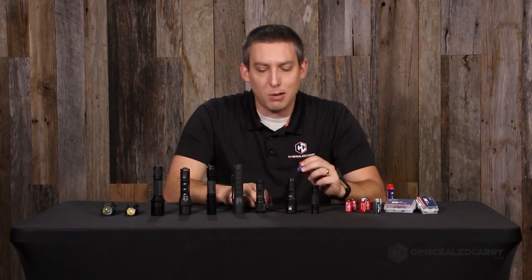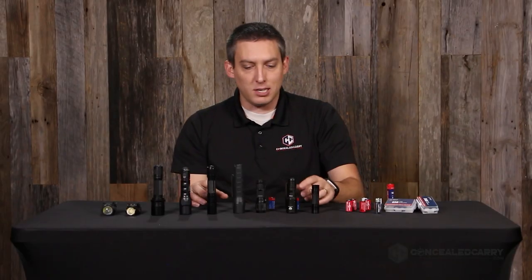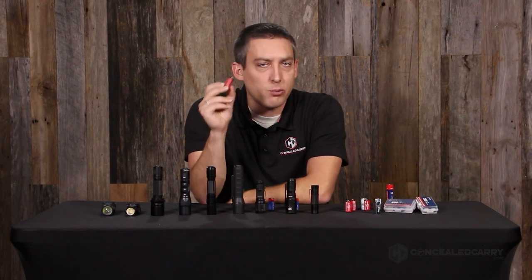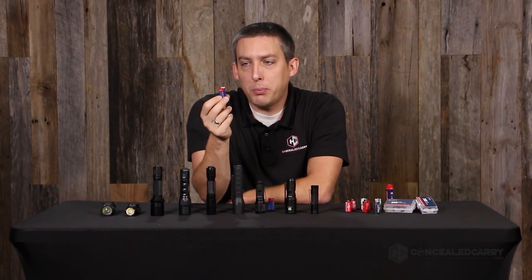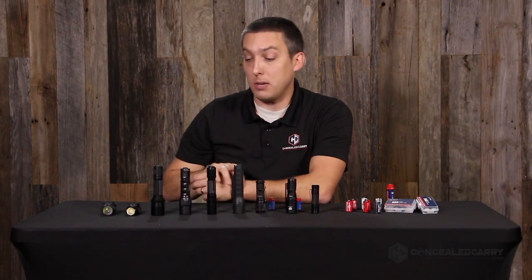But there's another feature that's less commonly discussed. With these lights, we're trying to maximize brightness — that's the point of having them versus a little AA battery light. What you may not realize is that you also increase your brightness with the 16340. These CR123A batteries are three volts, but the 16340 is 3.7 volts. So it's putting out more energy faster, allowing you to get a higher brightness level out of your lights. Some manufacturers publish lumen levels comparing standard batteries versus the 16340 on their website.